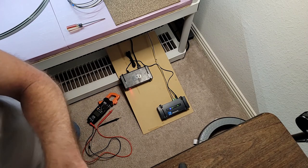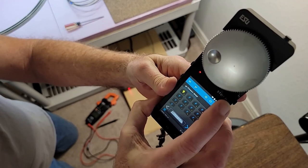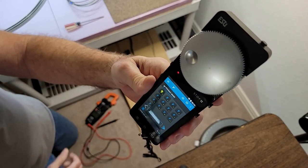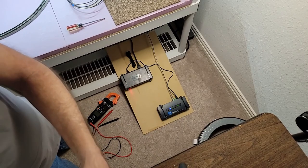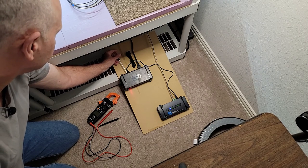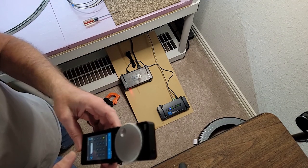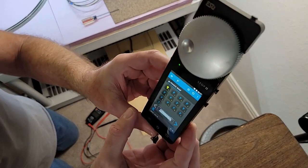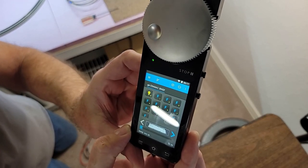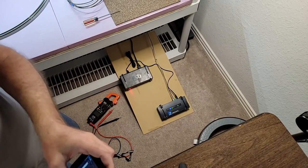And on the remote, on the throttle, you can see a momentary green flash. I can't turn on the track power. So what I discovered here is that in order to get this thing to power up properly, you got to turn this potentiometer up a little. So with that potentiometer turned up a little, now I have my little green light and we have track power.